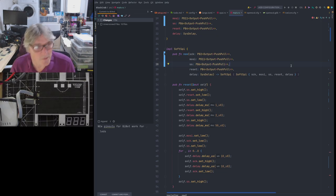Now, even though I could do that and that solves that problem, I would still have the problem that the QSPI would be terribly limited because we'd have to knock the frequency down to lower than 15 megahertz. So we'd kind of be shooting ourselves in the foot. There is a possibility that we could dynamically change the divider and give it a boost after we program it. We change the divider and then it works at a higher frequency.